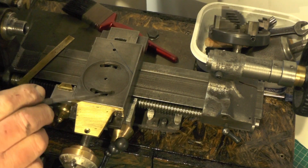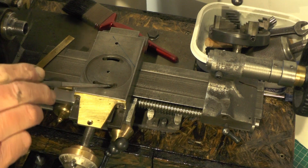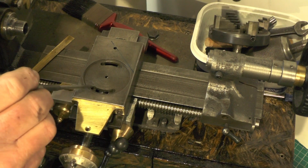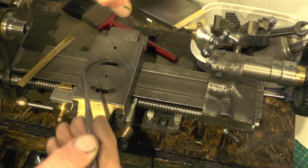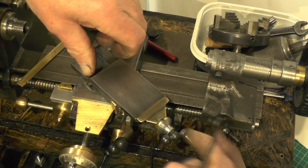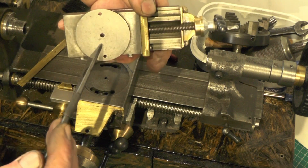No matter what I do I can only get 30 degrees doing it that way. Then there's another limiting factor because the thickness of this is very thin — it's only one eighth. The actual top of this dovetail on the cross slide rides right at the bottom of this — I'll call it the cross slide table. So I would have to put a counter slot in to get the head of a bolt to be able to locate, come through, and then two nuts on the top. So that's a few limiting factors in that one. If I want to get 45 degrees I would have to use this centre bolt here in the centre of this compound.